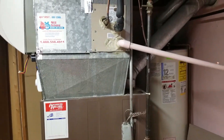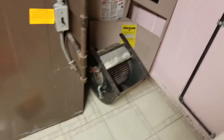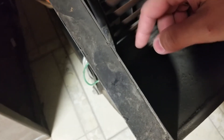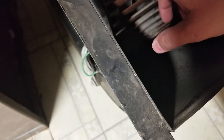The AC unit unfortunately conked out. I took it apart and figured out that the most probable reason is this motor right here. I heard it stop once and it was squealing, and a couple times when I heard it trying to turn on, you could hear a humming from the induction, but nothing was turning. So I heavily suspect that it's the motor.